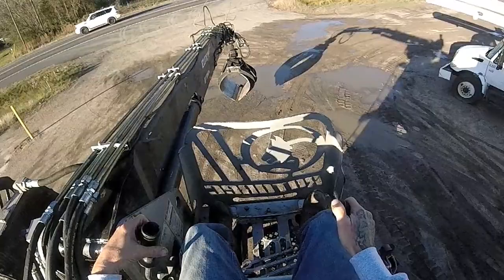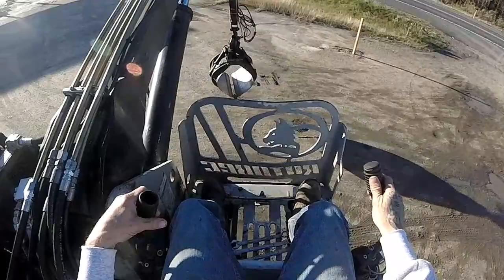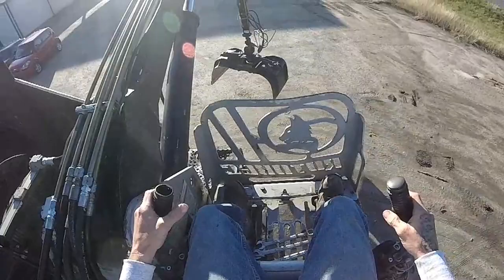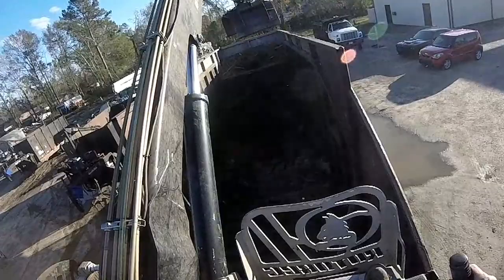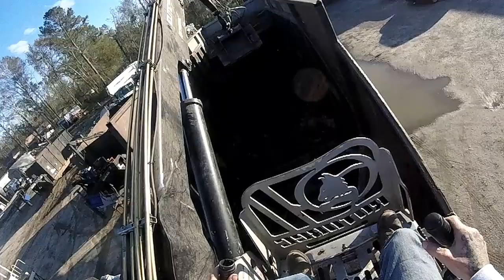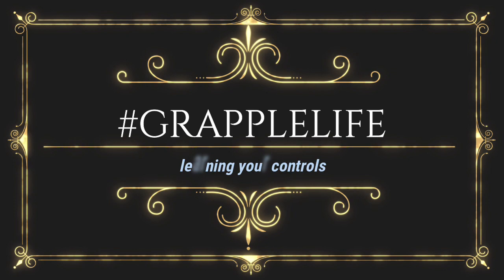And there's the rock. Okay, so until tomorrow: lift boom up, bring it out, bring it down to the box - a little extend to get out there. And there you go, that's how you run a grapple. Be sure to like, subscribe, and leave your comments below.